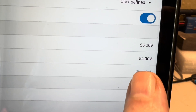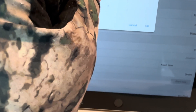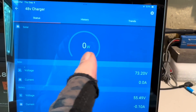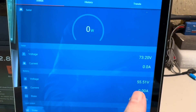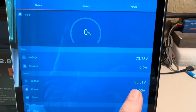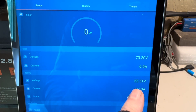So there I've got my absorption voltage set to 55.2. And let's change the absorption time — let's just run it up to six hours a day. As soon as I set that, look — no power coming in off the panels. It reads that battery voltage at 55.5. It's already up to where I want it, a little higher than what I want my absorption set. I set it for 55.2. I'm going to leave that and let it do that for six hours a day, then go up incrementally and slowly and see if we can't get that thing balanced.